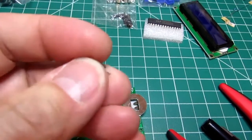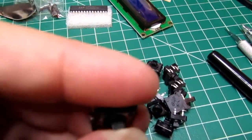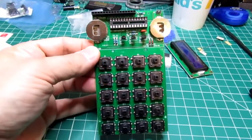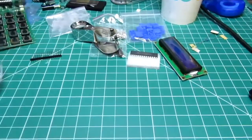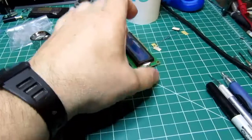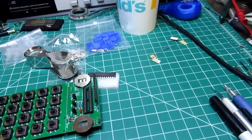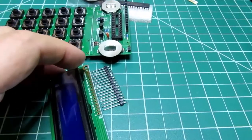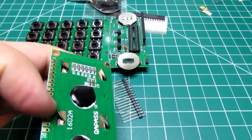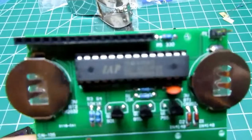I'm adding a two-pin shunt strip so I can hook up an external power supply. Now all the tactile switches get soldered on, completing the circuit board assembly. Next, a male pin header is soldered onto the LCD display in such a way that it'll fit down onto the board at an angle — which is a little awkward because the case is designed with the display tilted. The header needs to be bent to the correct angle. Almost forgot — the IC goes in too.